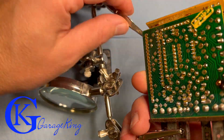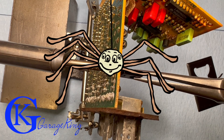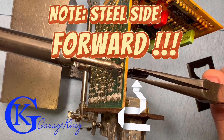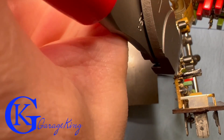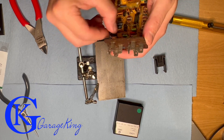So let's begin. The first thing you're going to have to do is set it up on some contraption that will hold it steady — unless you have eight arms or a bunch of people to hold it together. This is the best I could do with this clamping system, and it wasn't that great. You can see I'm struggling to take out the transistor because there are three legs on it, and when I heat one I just can't get it out, so what I'm doing is cutting one of the legs and giving it a wiggle to break it off.